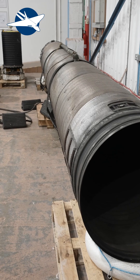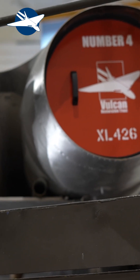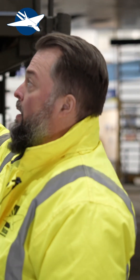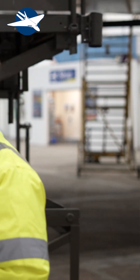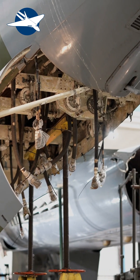For access just to get to the boom, we've had to take out the jet pipe, the end cap, and skin part of the jet pipe tunnel — all of that just to gain access. The other side of the boom is quite major work; this is about as major as you go on this aircraft. The aircraft is up on jacks — stress jacked — with an extra trestle in the back here just to make sure the aircraft doesn't move.